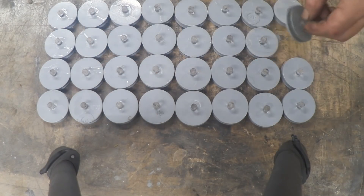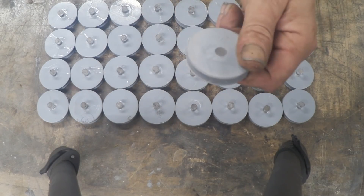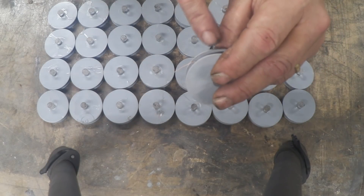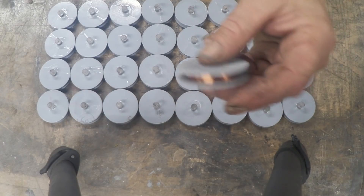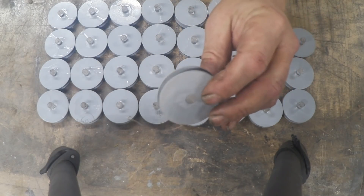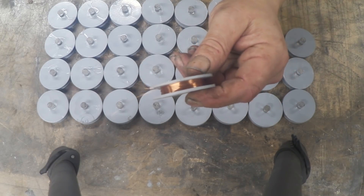When I measured up it turned out I needed 32, so I made 32. I've left a little bit on the inner bar so I can put them in the lathe when it comes to winding the actual coil. There's a coil I've already turned — I just chucked it in the lathe, wound the coil up, then removed the stub and sanded it flat, giving a nice flat coil. I need to make sure all the other coils are roughly in the same region by measuring distance from the edge. I've got one made; now I want to test the idea by sticking this in the exercise bike.